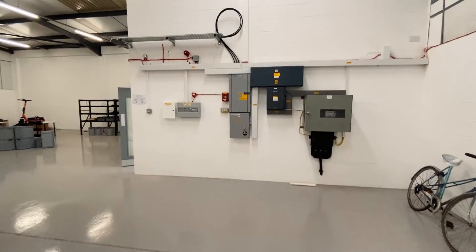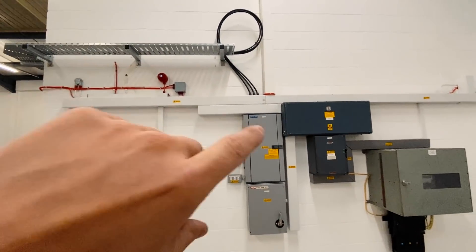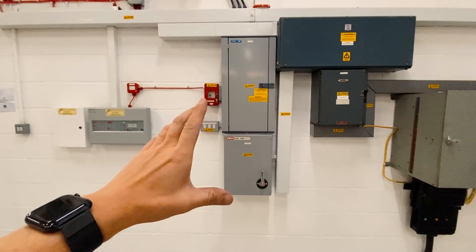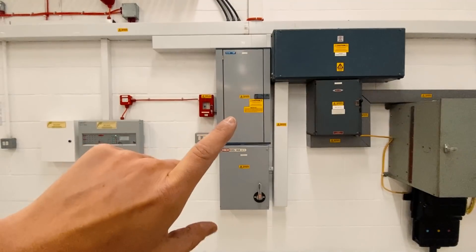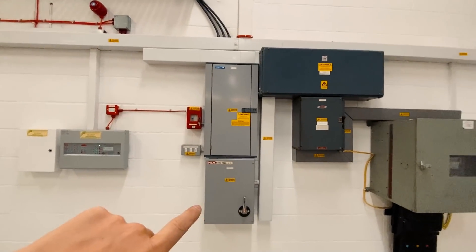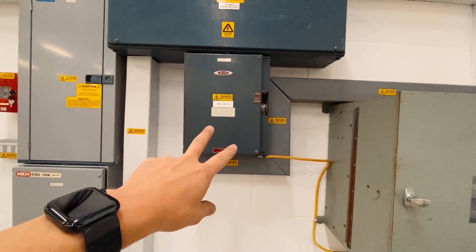And you've got these lovely little electric delivery bikes as well. So here we are, we've got it done. It's been a long day - it is now quarter to seven. You will see that there's a funny little wisp of cable here. We've done that because we're going to be changing this distribution board to a bigger one as they've got a lot more sockets that need to go in. We've left extra slack on the cables so that in future we can terminate them straight into the new board. This is a 200 amp busbar with 50 or 75 mil tails coming up into it from this 200 amp main switch.